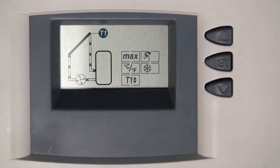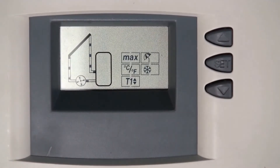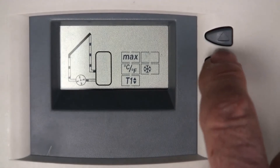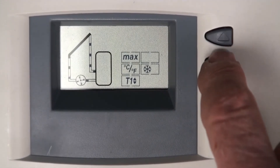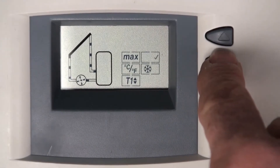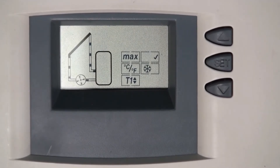Now we see the umbrella flashing in the little box on the right — that's the vacation mode. Please read the manual on when it should be activated. To activate it, press and hold the set button in the middle until you see a check mark to the right of the umbrella. The check mark is present — the holiday function is now active.